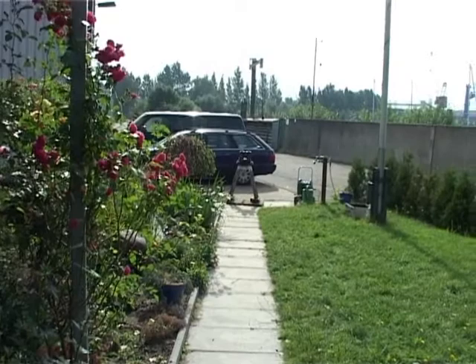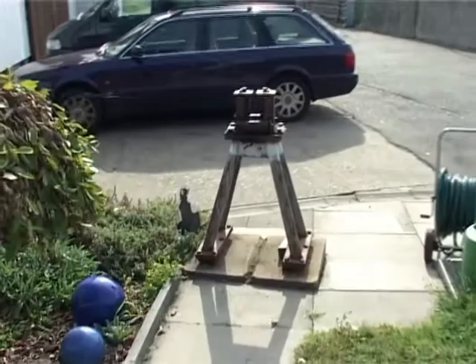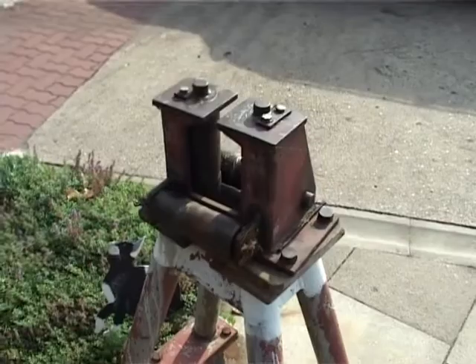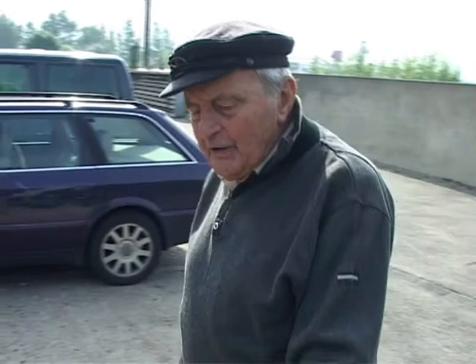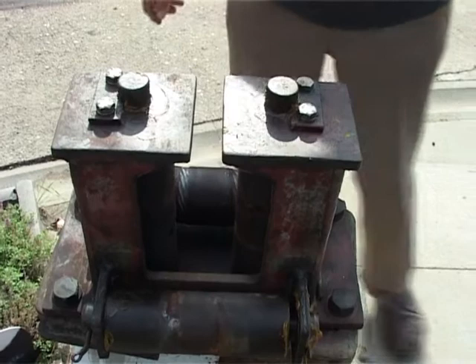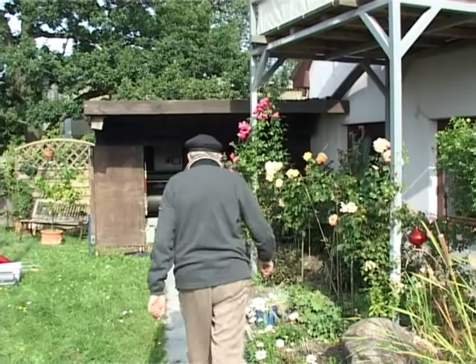Outside there is the guide frame (Bock), which sits exactly in the center of the drum. It has the advantage that the wire is guided so that it spools cleanly onto the drum. Therefore it is arranged so that there are rollers here — two bottom rollers and two side rollers — which keep the wire guided cleanly. Then it does not matter whether the wire deviates left or right behind the Bock, because from there it stays centered. This ensures that the drum does not overflow and the wire does not overlap. I have taken the bolt out here to show you.